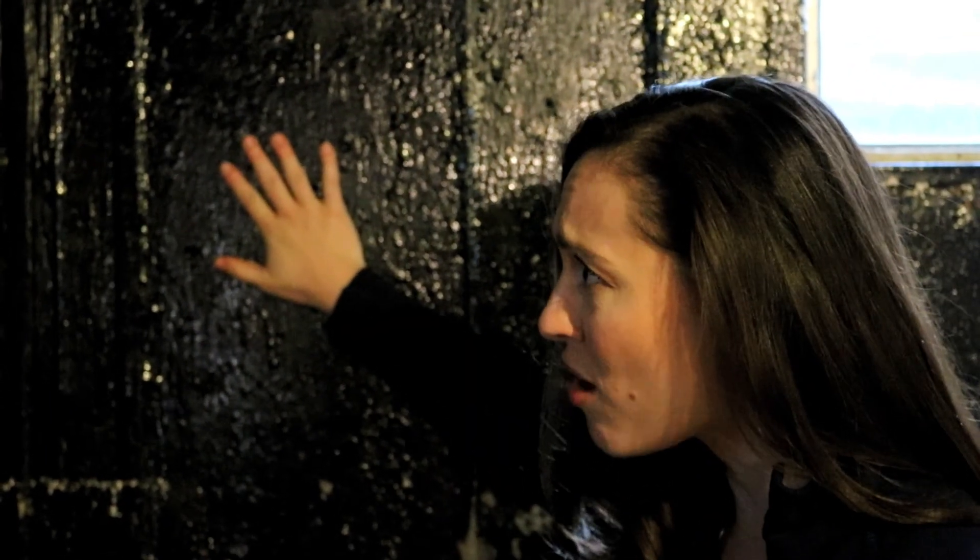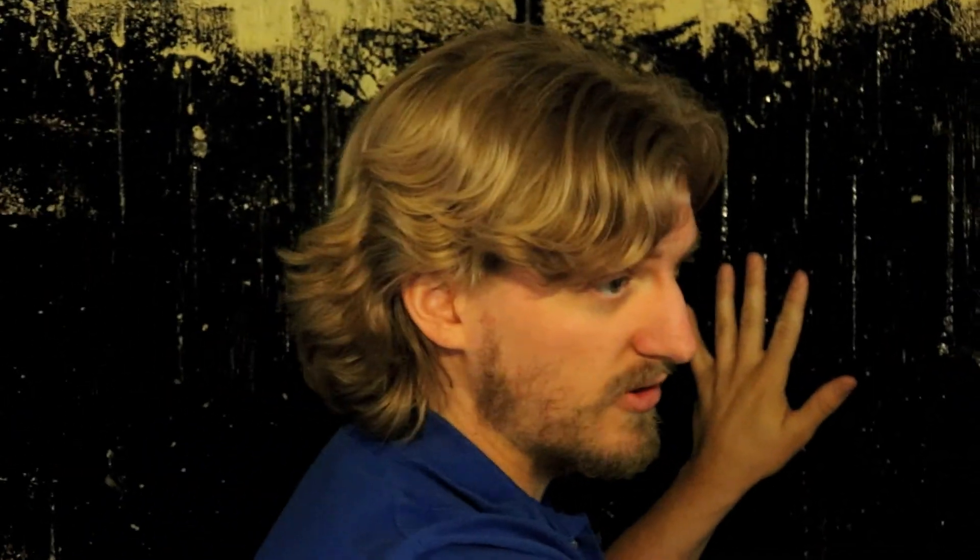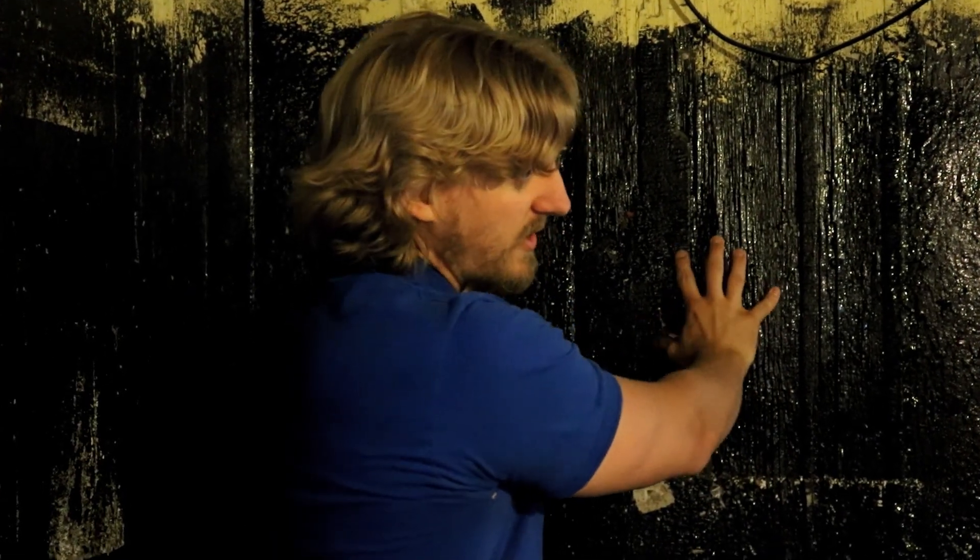So what is this? Is this tar painted on the wall? Originally a contractor painted this tar on the wall to try to help seal the wall from any sort of seeping. So they're trying to stop the water once it's already come through. It's not working.